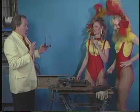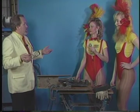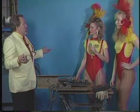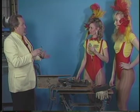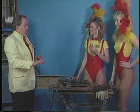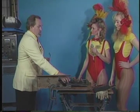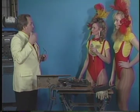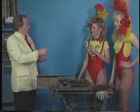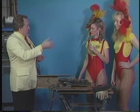Although I must say, in defense of this stuff, and I want to tell our audience, I did this before I had Heliarc. I didn't always have that stuff either, and I spent an awful lot of time, maybe 15 years, when all I had was the buzz box and the oxyacetylene. Most people would just use the buzz box stick welding for heavier stuff, but I got to the point where I could do 20 gauge stuff like this just as nicely as I could with oxyacetylene welding, and things like expansion chambers, exhaust tubing systems. I could weld it up very nicely with the stick welding. So it can be done. It does take a little developing of talent.